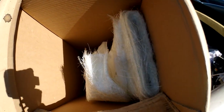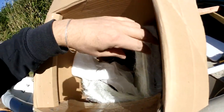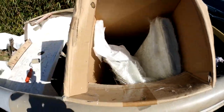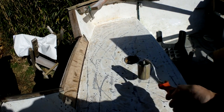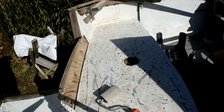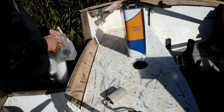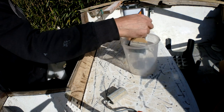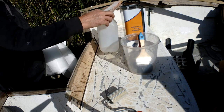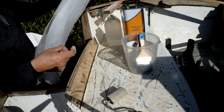Fiberglass - lots of fiberglass. This is the coarse stuff. This material isn't actually fiberglass but it's really good for going over joins and making it smooth. I've also got a thinner grade fiberglass I'm going to use. Not my favorite job, but it's got to be done - need to get rid of the bubbles. We need the resin, a mixing bucket, brushes, acetone - about half a bottle - this is the fine mesh which goes on top of the coarse mesh at the end to give it a nicer finish, and of course some catalyst for the resin.